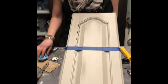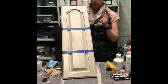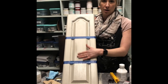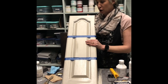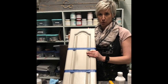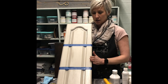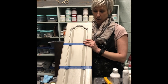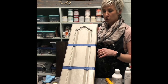So as you can see, it totally gives three different looks. There's lots of different techniques and looks you can get when you change the color of the wax or the color of the paint. That is our finished cupboard door. Kitchen cabinets are basically like painting furniture — you just have to take your time, take all the doors off and the hardware off, and prep your space so that you've got room to work with your cabinet doors. Giving them a good two to three weeks cure time is the best result you can get. Once it's on there and cured, this paint is not going anywhere because it has that resin content — it's really going to dry to a hard finish.